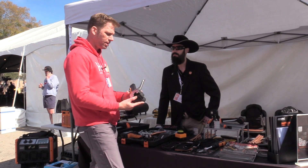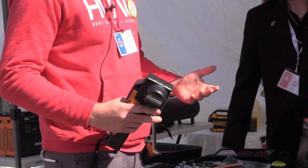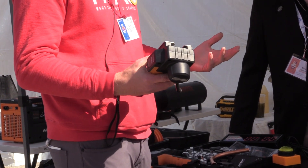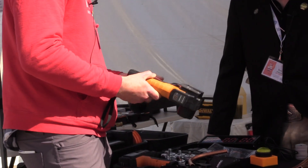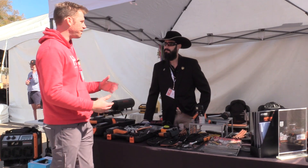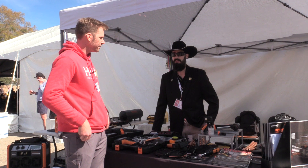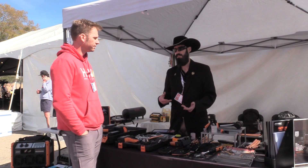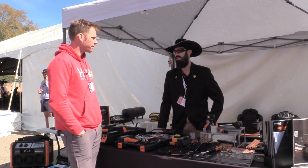The first time I went to use this, I wanted to make a video on it. I practiced before turning on the camera and it was just perfect - so easy. Anybody can make a good flare. Whereas with manual flares, a guy who's decent at it - two out of five are going to be leaking. That's pretty bad. Whether you do it by hand or with a drill top, there's a hundred different ways, but by manually doing it, there's no way to do it perfect every time.